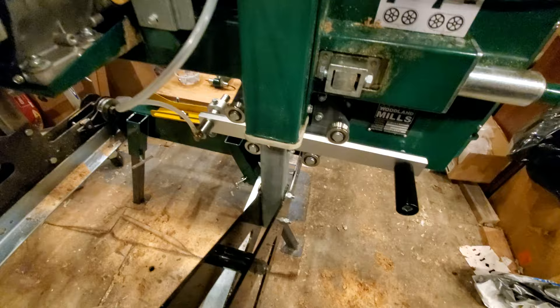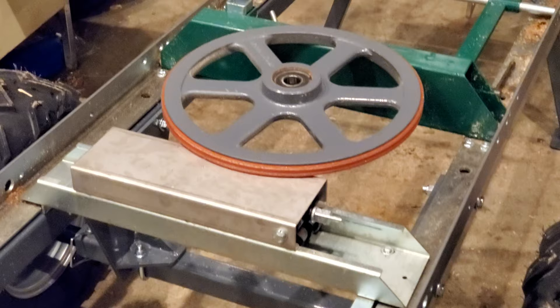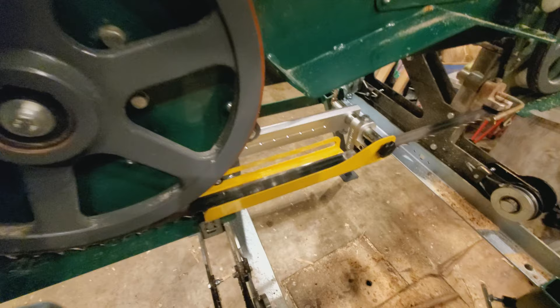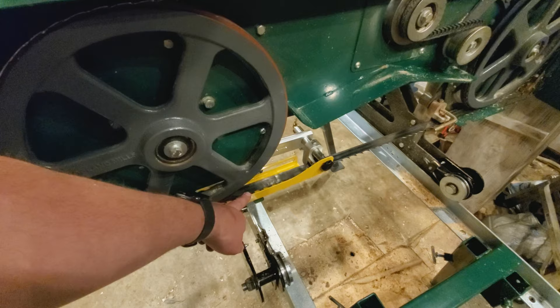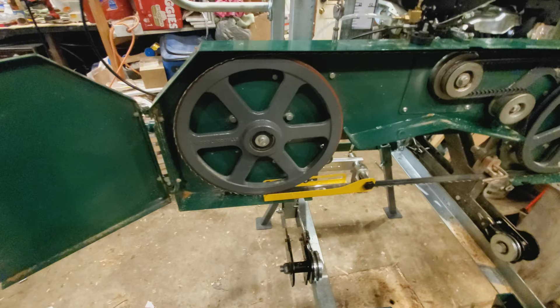So next step is to put the flywheel on, get a blade on, and make adjustments. One adjustable blade guide later — it is installed. It is fiddly because you've got to set this arm. You probably want to pull it all the way back, set it, but don't tighten it; run it all the way forward. That gets you your pitch there. It takes about three times back and forth to get it all right, and then tightening, loosening, tightening, loosening — because when you tighten stuff up, things want to walk on you.